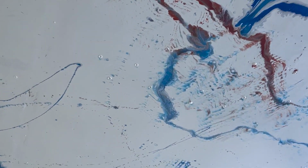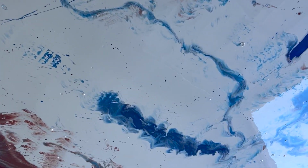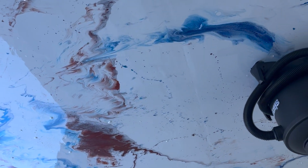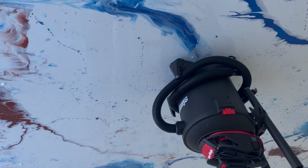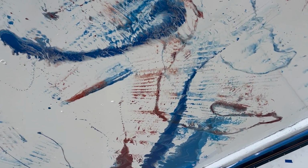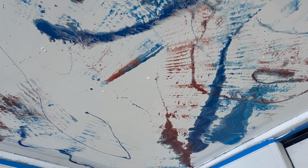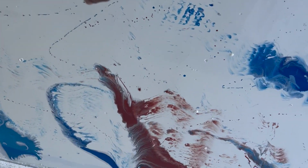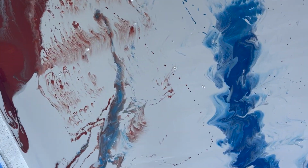So I'm thinking either just go through the whole garage, sand down every spot that I see, and then once I do that, I just fill it with some epoxy, let it sit for an hour or 2 or maybe 3, and then sand it back down so it's leveled with the ground, and then put the top coat on, so it will be 100% finished. But also while I'm doing that, when I'm done, I gotta clean out the spot with some alcohol. So when I clean out the spot with some alcohol, it should be good from there.